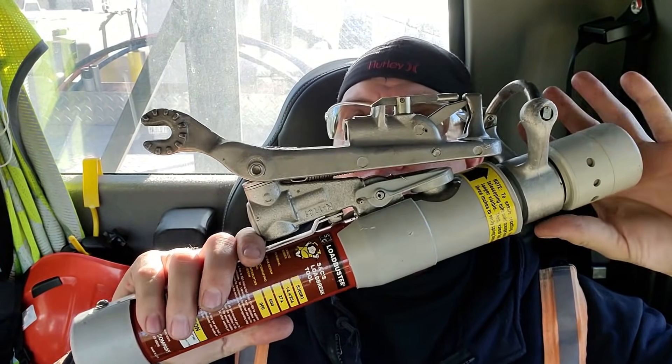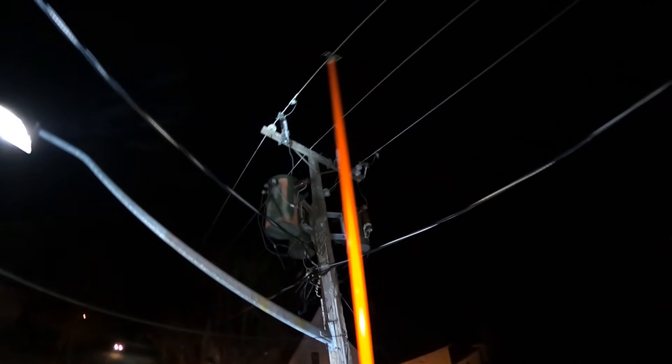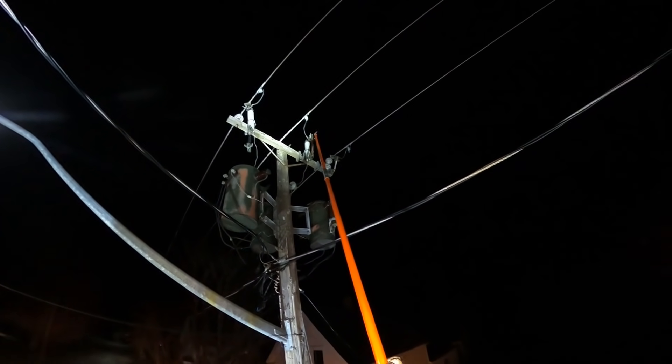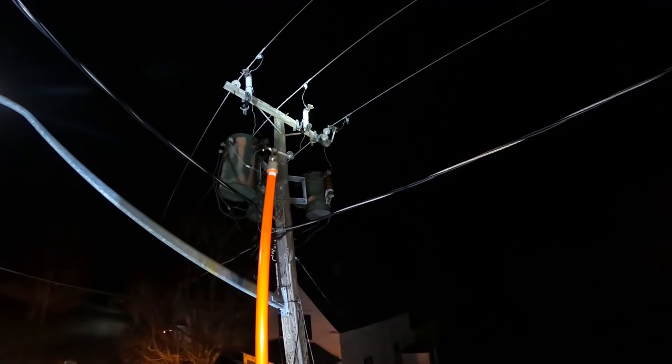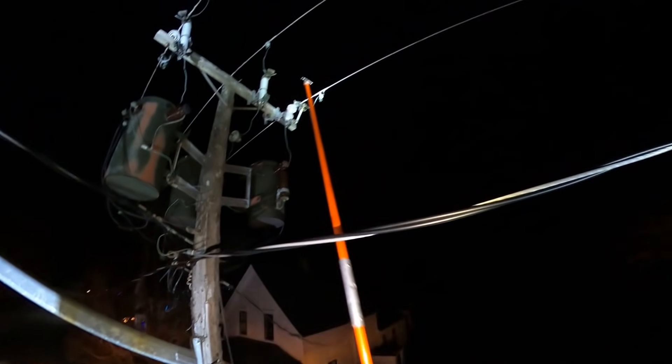In this particular case on this night, when removing the load we were using what's called a load buster. This hooks onto the cutout at the top of the door; this guy hooks into the bottom. As you open it, there's a spring mechanism in there that quickly extinguishes that load. I've actually got a video showing step by step how this functions — I'll put a link in the comments. If it's only a 50 kVA transformer feeding three or four houses, grab your long stick, hook that in the cutout ring, and open it — you're not going to draw much of an arc. The actual procedure in our books is we're allowed to open a cutout without a load-busting device as long as there's 10 amps or less on the cutout. Some cutouts even have an arc chute built right in, rated for 200 amps interrupting I believe — don't quote me on that. If anyone knows for sure on a 200-amp cutout how much that arc chute is actually rated for, let me know in the comments.